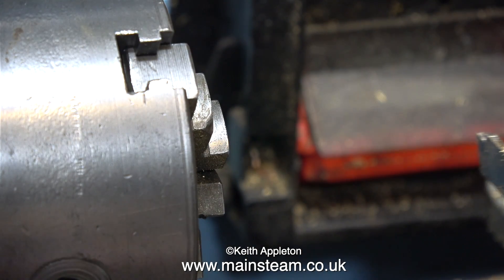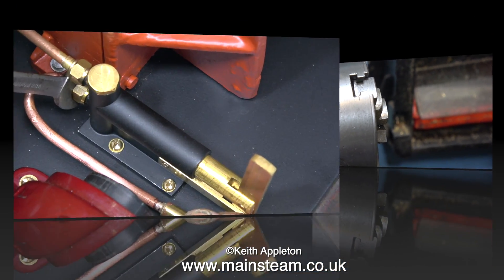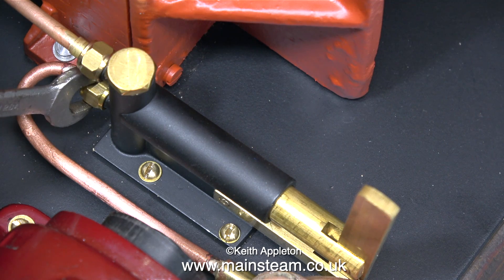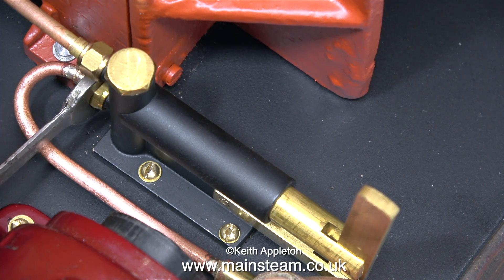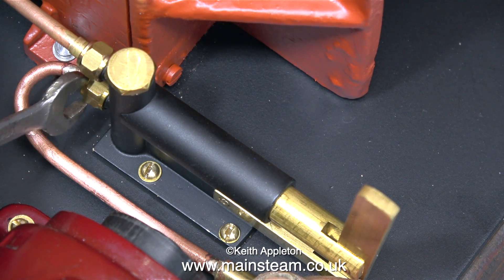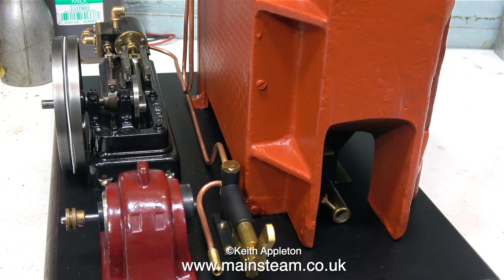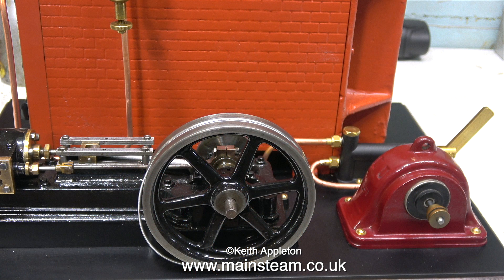I found it, took it into the outer part of the workshop and silver soldered it to a piece of pipe. The piece of bent pipe with this fitting on the end is then bolted into place on the pump. The upper pipe on the pump feeds to the clack valve — or check valve — which is a one-way valve to allow water into the boiler but no steam and water out. Here you see the general arrangement; the pipe still needs straightening up and the main steam pipe needs cladding using some string. The job's starting to shape up now and it's almost time for a steam test. That's it for this episode — thanks for watching and I hope you found it useful.